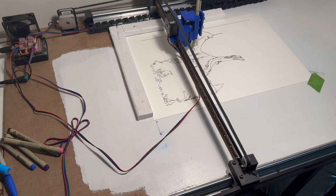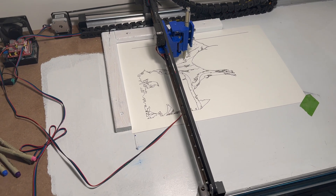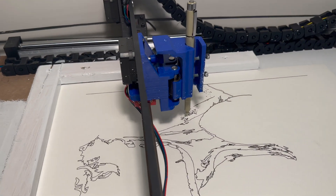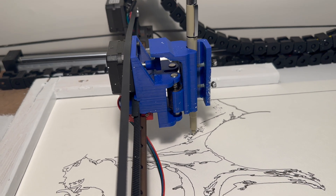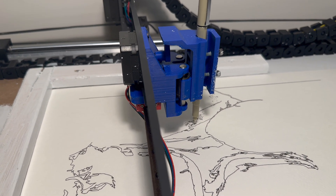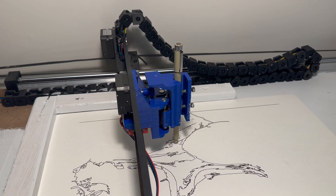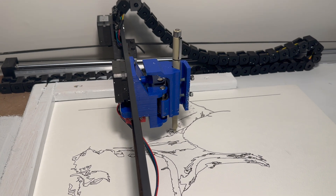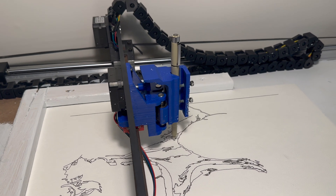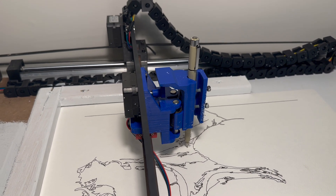What a plotter is is just a gantry like this — it's technically a three-axis gantry, but really the main part is just two axes. Then you just plop a pen onto the end and figure out a way to lift it up and drop it down. I use a little stepper motor for that. Before I made it a stepper motor, I used a servo, and you can do that as well — though I know you need to use a different version of GRBL. I can put the version of GRBL that I used in the description, because I know it took me a while to find one that actually worked properly.